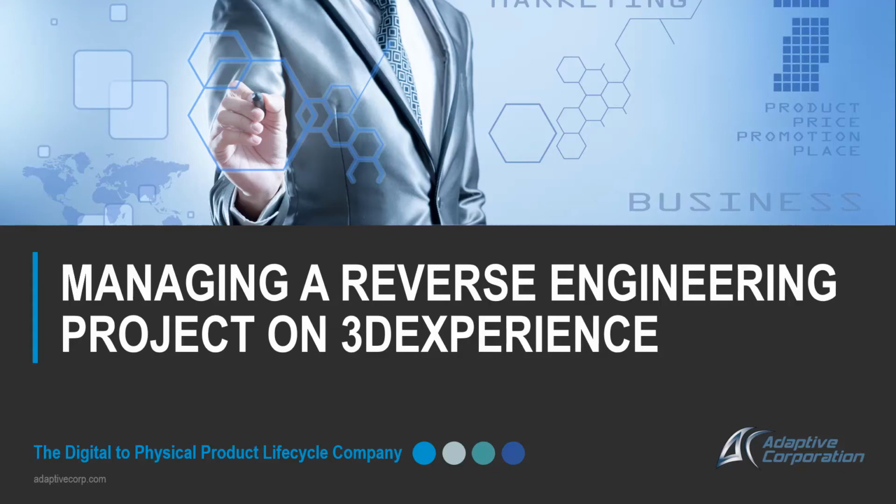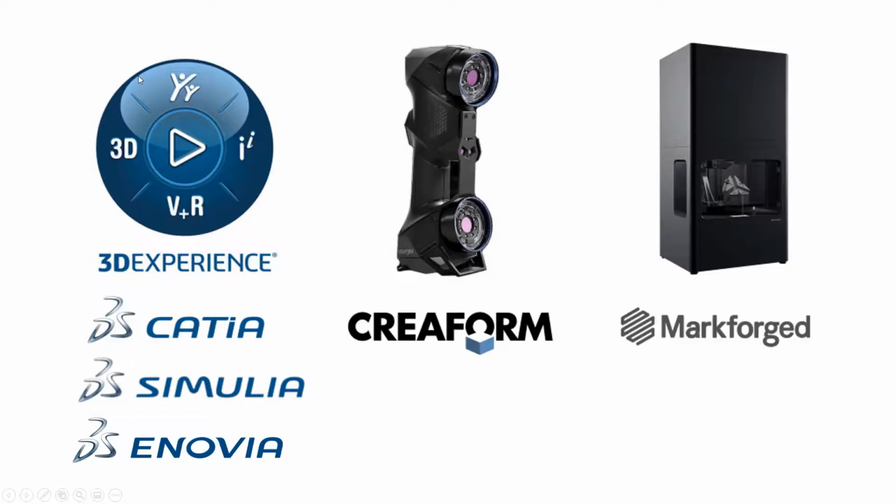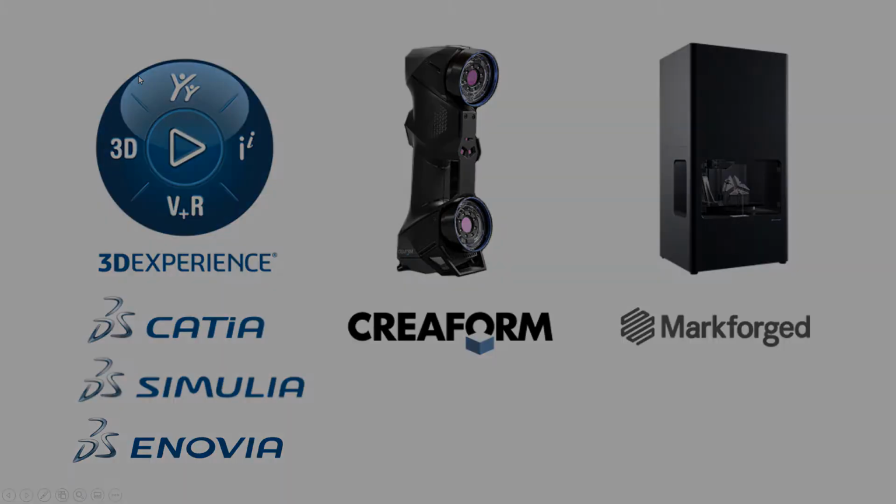In this video, you're going to see a team working on a reverse engineering project from end to end. Different software and hardware are going to be used along the way. Enovia, CATIA, and Simulia are going to be used on 3DEXPERIENCE in order to govern the project, re-engineer the parts, and validate it with simulation. The Creaform HandySCAN BLACK scanner will be used to digitize the part at the beginning of the process. Finally, the Metal X printer by Markforged is going to be used in order to 3D print the new re-engineered part.